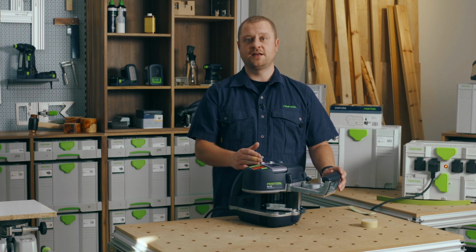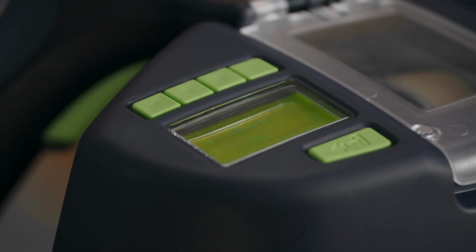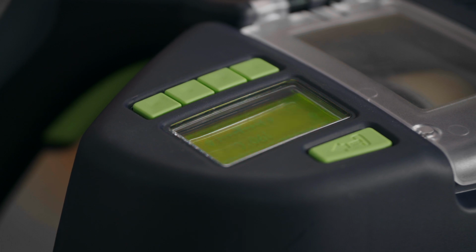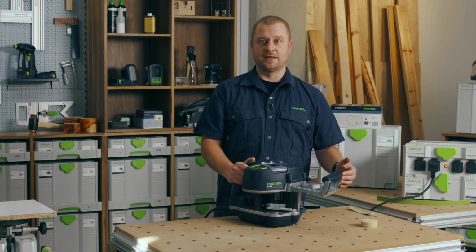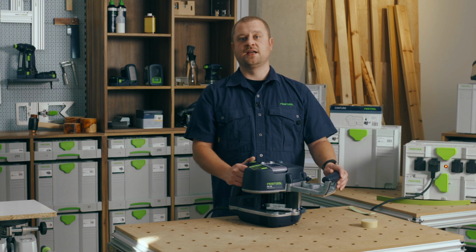Once the set temperature is reached, the screen will change from red to a flashing red and green display, and a countdown timer of 5 minutes will start. This countdown is to ensure any glue from previous use is molten and expelled into the drip catcher, guaranteeing fresh glue is applied each time the CONTURO is operated.